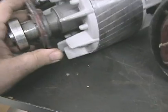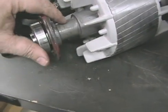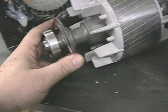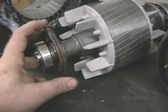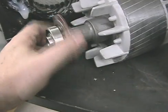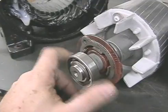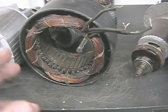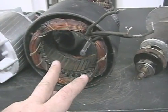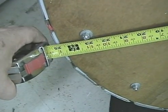You will have some leakage because there's no seal on the inside, so you'll have to keep an eye on it. If I were doing this for permanent use, I would press-fit the core bearings off and remake this piece to include a seal. But for these experiments it's not really necessary. These roller bearings are a lot more efficient than the little AC induction motors that have no bearings — they're sitting on a felt-type material with a steel retaining clip on the ends, which adds drag. Something to consider if you're thinking of converting one of these old three-phase motors into an induction generator.